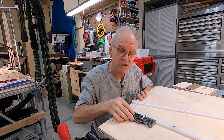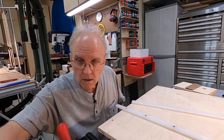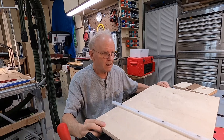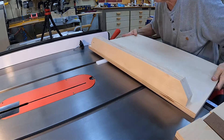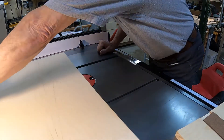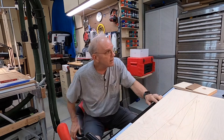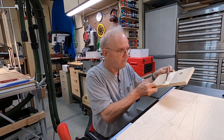You can lay it down flat and go right in — it covers the whole thing. That's what the shoulder plane does. You don't want to plane the whole side. Once that's done you can screw it down. This thing fits in here and slides really nicely — it's good and tight so it won't wobble back and forth, and it'll be square and true.